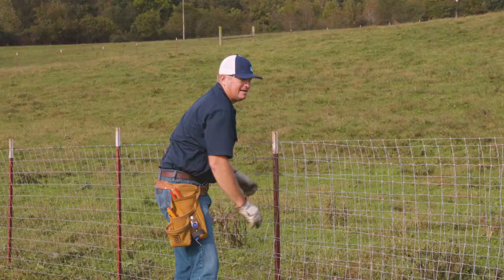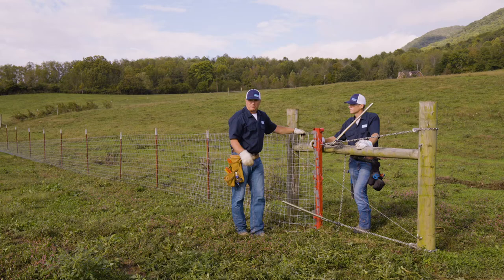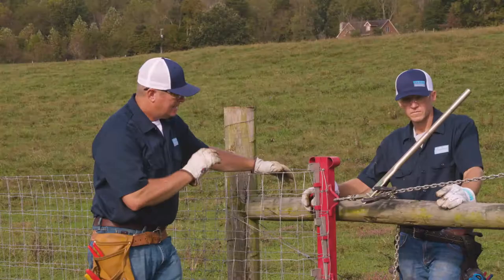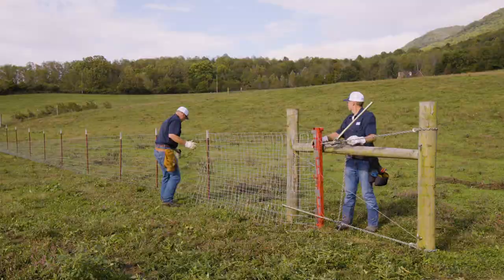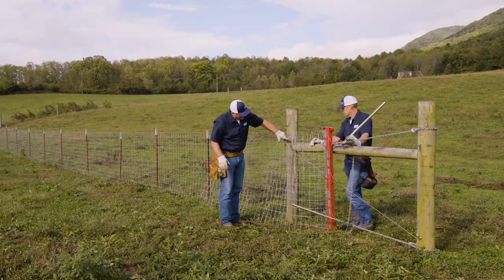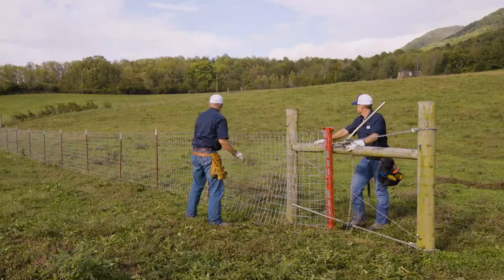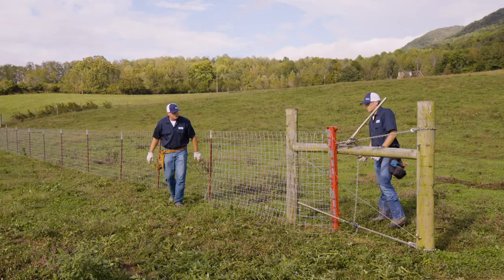It's very important on high tensile to never stretch the fabric. If you stretch high tensile, you break the grain structure inside the wire — it'll start to elongate and you'll have problems. The beauty of high tensile is it just needs to be good and tight. If it's tight, it'll maintain its integrity through heating and cooling and you won't get slack wires. You never want to take away more than half the height of the tension curves, and I like about four to six inches of flex between my posts. We've got a good snug fence — we'll tie it off and we should be good to go.